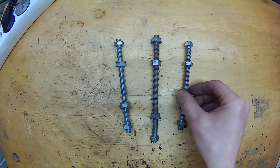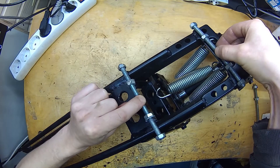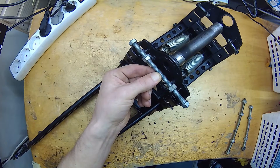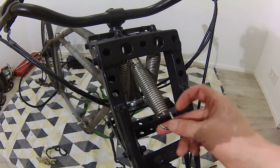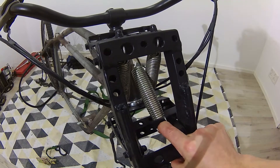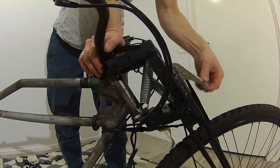Here is a little trick for holding parts in place and keeping correct measurements while welding: take a couple of threaded bars, some nuts, and use those as a jig for holding parts together. When you are ready to put together or take apart a spring configuration like this, you will need to apply some pressure on the main springs and then attach or remove the counter spring. For that I use a ratchet strap.